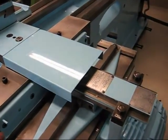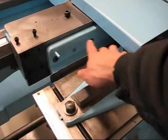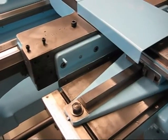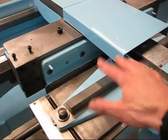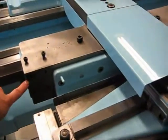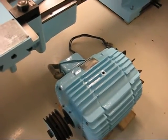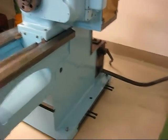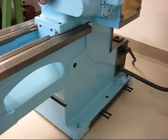The cover is on — that's homemade because the lathe was missing that cover when I got it. I'm also missing the covers that are supposed to be here: a cast iron cover that sits on this peg here, and a peg in there and one there. It should have a drip tray too, going from this cover into another cover that's under here — I have that but just haven't mounted it yet. And here you can mount the coolant, but I'll just put the screws in there because I'm not using coolant. The motor is still on the floor — I'll wait a little bit since I'm not sure if I should mount all the castings around the belt before the motor or after.